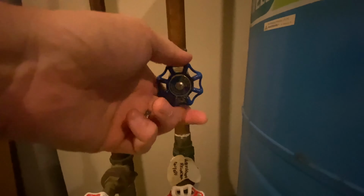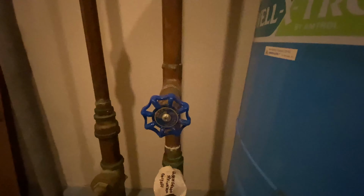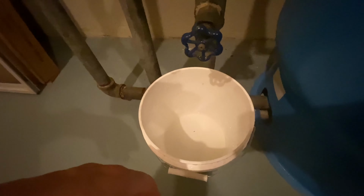But if we turn on this thing right here, this is actually an excess drainage release valve thing, whatever you want to call that, because I'm not sure if it leaks from here or if water just comes back down from this pipe. But basically, if you don't have this thing open, water can collect here and just fill up and up and up throughout the winter. And if it fills up high enough, it can actually freeze and crack this pipe right here. So that's why you want to leave this thing open during the winter, so that if there is any excess water coming up through here, it's going to drain down through here, right through this thing. So that's why we generally keep this thing here throughout the entire winter, just in case anything does have to drip through here, it's got a place to go.